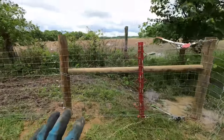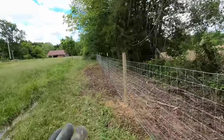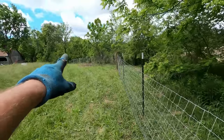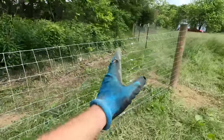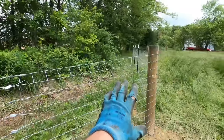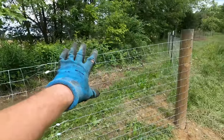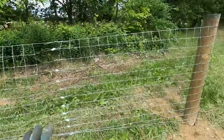We've had to adjust a few things. This side is fairly tight with our Gripples in here, but every time the fence goes around a post it gets looser — this is the tightest section and each subsequent section is progressively looser. We actually have a staple in the top of each wooden post just to somewhat hold it up, or else it would be laying down. So what we've done is put in a second splice with a bunch of Gripples right here in the middle — this will allow us to tighten this section independently. It's because it's dragging on each post. When we splice this fence back together later after cleaning it all out, the fence will be straight right through here, but for now this is a temporary solution to try to even out tension across all the sides.